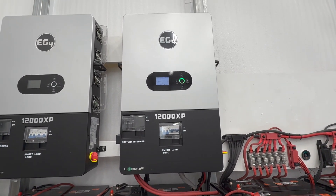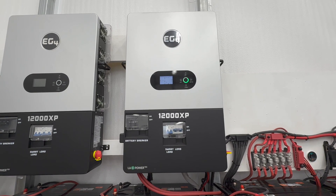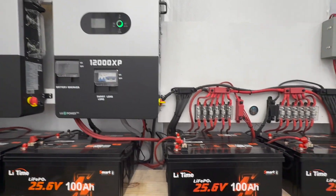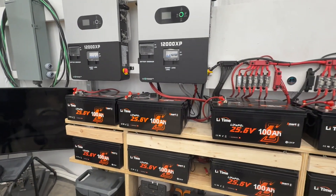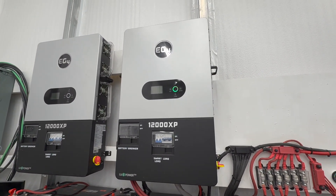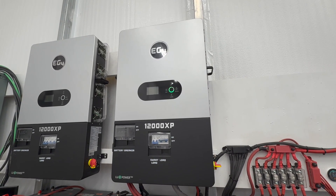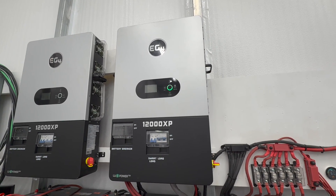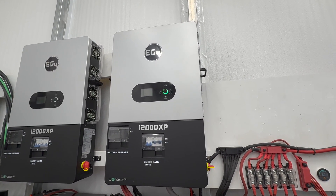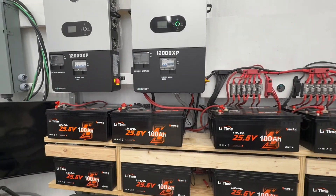If you can find a low-frequency inverter, those may be a little bit better in some situations, but these new high-frequency ones have a lot of protections built into them. I have it connected to 24 lead-acid batteries. One of the important things with this inverter is you have to ensure you have a certain amount of amperage available, so it can produce its full output. They say you need a minimum of 300 amp-hours of batteries per unit, but for mine I've got 1,200 amp-hours currently connected.